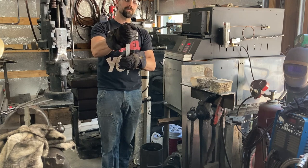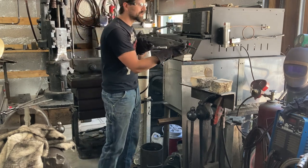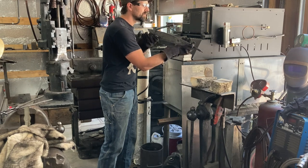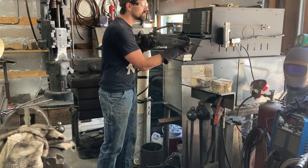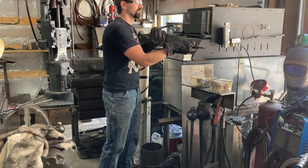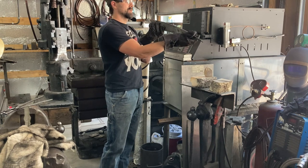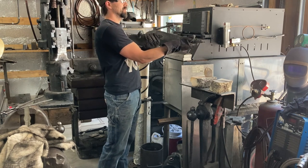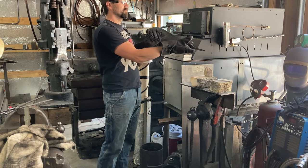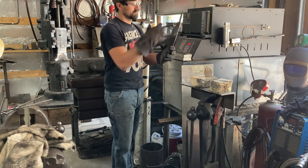Not super crazy about that. And I do try to look at it against various backgrounds, both light and dark. Sometimes you think you're seeing it pretty well, but then if you switch it to looking against something else as a background, you'll see it better. Okay. Oh, now what's happening? Also, it's important to keep checking it as it cools down, because sometimes things will move during the cool down process that weren't initially there right after the quench.